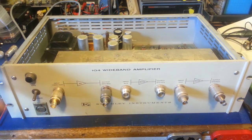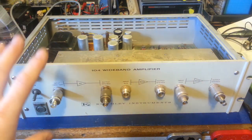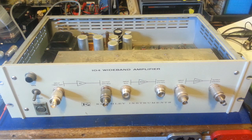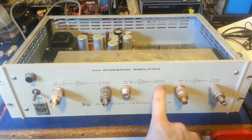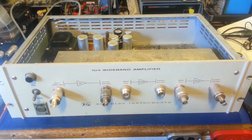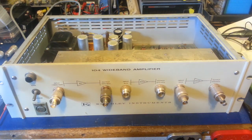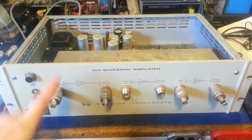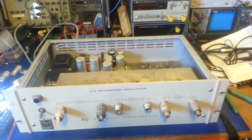I've wanted something like this for a long time. The problem is the majority of laboratory wideband amplifiers - and that was the other thing I wanted, a wideband amplifier, because I deal with all sorts of frequency ranges - but the problem with most of them is their 50-ohm input and output. You can see here: output 50, input 50, output 50, input 50. That's what makes this one kind of unique: one megaohm at one picofarad - an extremely high input impedance. This thing is old, probably can see that just by looking at the mountain of electrolytic can capacitors back there, but what gives it such a high input impedance is a tube. It only has one tube; everything else is solid state.